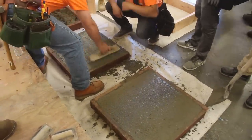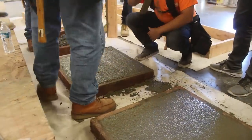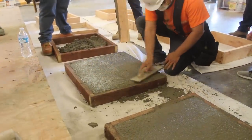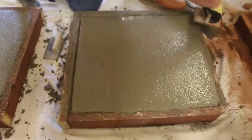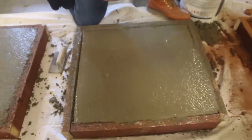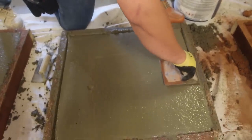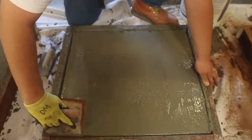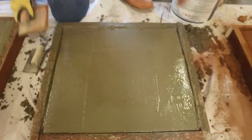There's the hand float — I've got a wood hand float here. John's showing the usage of it. What we used here was a quick crete bag mix, your basic 2500 psi. But we added about two shovelfuls of raw powder Type 5 cement to these bags — for every five bags, we added two shovelfuls of common cement. That's why we're able to finish this so nicely. You notice the cream on that, there are no rock pockets on the edges, and you don't have to fight it too hard because of the excess cement we added.